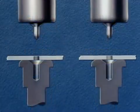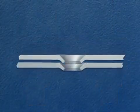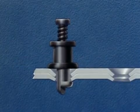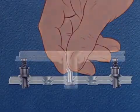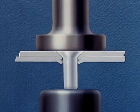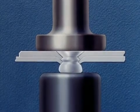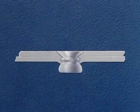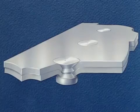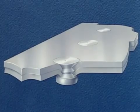This difference in angles is necessary in order to get a good nesting of parts. Upon completion of the dimpling operation, the parts are reassembled. Sheet metal riveting clamps are used to hold the parts together until riveting is completed. The rivet is inserted, and from here on the work proceeds using a regular flush riveting set and the ordinary bucking bar. Driving this type of rivet requires the same skill as in the former dimpled method — it is very important that the rivet be driven straight. We have just illustrated the pre-dimpled method, used when the sheets are too heavy for the double-dimple process.